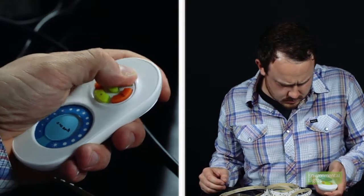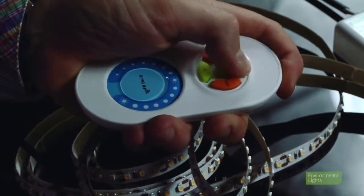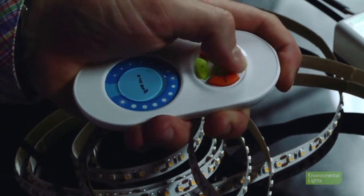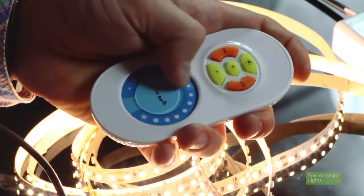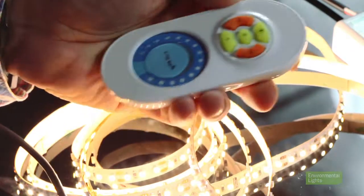Rather than pressing the brightness button once and hoping I got the timing right, I like to consistently tap the button as I reapply the power. Most of the time, if I'm tapping the brightness button quickly enough, one of my taps is bound to catch the right moment, and Yahtzee, we have control. This can be done with a single controller and can also be done with multiple controllers at the same time.